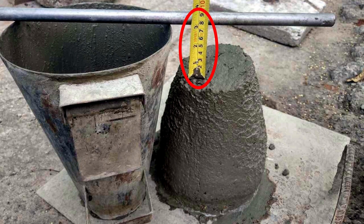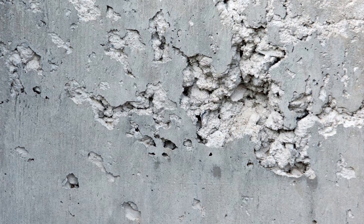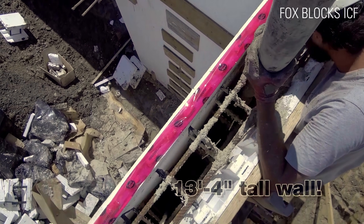Next, the concrete must be properly prepared because it is a vital part of this wall. The concrete in ICF walls must have a slump of 5–6 inches, which is higher than the slump for a floor, which may be at 3 inches. The proper slump allows the concrete to be pumped and to flow more efficiently. A lower slump can create voids and honeycombs in the walls, which can create more hydrostatic pressure and damage the blocks. The aggregate must be between 3/8 of an inch to 3/4 of an inch; using larger aggregate may cause congestion between the form wall and the reinforcement, resulting in voids. The 28-day compressive strength of concrete must be at least 2,500 PSI, but preferably 3,000 to 4,000 PSI, because this helps the flowability and pumpability of concrete. The concrete is poured in 1-foot to 4-foot increments to manage concrete pressure and reduce the risk of blowouts.